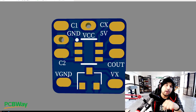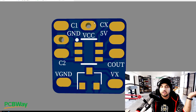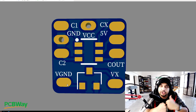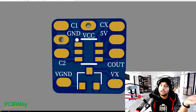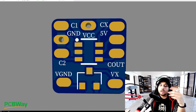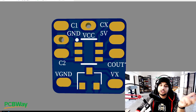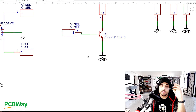The two pads on the bottom are for enabling and disabling the video transmitter with a switch on your RC transmitter. VGND is the VTX ground - the video transmitter's black wire connects here. The positive still connects to VCC or the flight controller's 9V. When connected here, the VTX ground isn't bridged to system ground, so it won't boot. VX, connected to motor 6 pad for example, bridges that ground and powers up the VTX. All sections are optional - you don't have to connect any part you don't need.